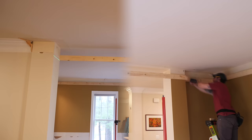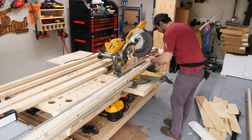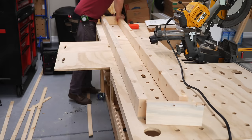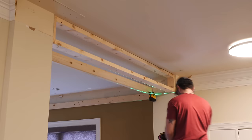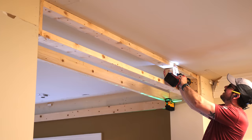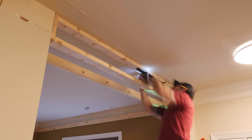The other half of the framing on the wall opening was on the other side. I referenced my line laser, marking the height at each end of the opening, and used the laser measure to get the length. I cut pieces for the two sides and top and bottom of the framing at the miter saw and screwed them all together. After test fitting, I attached the framing to the wall, making sure the bottom edge was in line with my laser and the face was plumb. I set the framing back half an inch from the column faces to allow me to cover it with half-inch drywall later. I came back and filled in the framing with blocking, cutting the blocks to fit as the height varied.